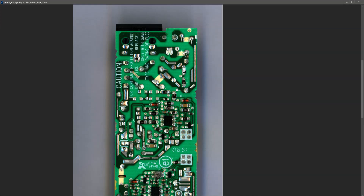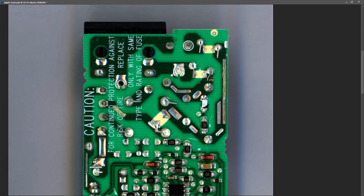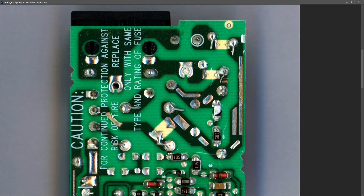This is the power adapter — I had to take it out of the enclosure and scrape off a lot of glue, but this is as clean as I can get it. This is our input section here, where a three-pin connector comes in from the mains. When I looked at the other side, I could see the component that blew up when I plugged it in was the fuse. It must have tripped a breaker originally without blowing the fuse, but it certainly blew when I plugged it in. The fuse is blown, and there is also a piece of track missing here — it looks like that was blown off the board as well.